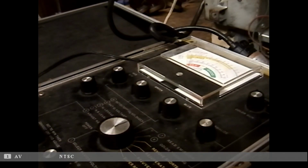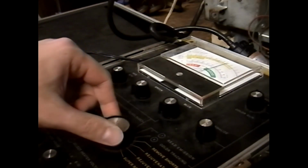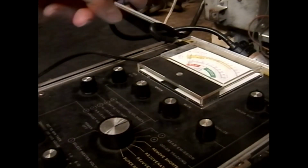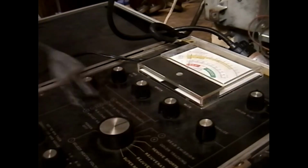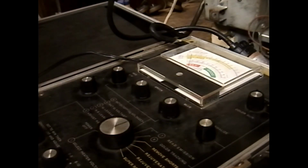Okay, so it has been around 3 hours. Right now, this is the emission at 8.4 volts. This picture tube, I'm pretty sure, is shot. Before we completely rule it out as dead, I'm going to quick try touching up the solder connections on the base. And once I've retouched the solder connections on the base, if the emission has not improved, well, I'm declaring this picture tube dead. And at which point, I'm going to pull all of the vacuum tubes that I care about off of this chassis.